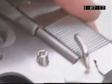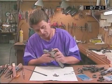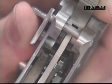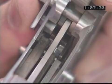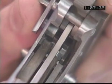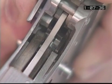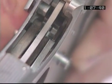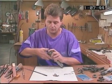So you want some full contact with it. You want to have as much contact as possible. Okay, so now you're actually working the trigger there, right? I'm letting the trigger break, and you can see the sear riding up and down in there, and that's what actually fires, trips the hammer. And so when the safety goes up, that prevents any rearward movement. So the safety would go up and that would push that piece of metal down. It'd keep it locked in place where it's at.